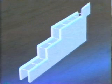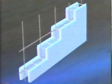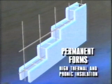The Polycrete wall is made up of polystyrene expansion type 3 prefabricated sections that can be inserted into each other. Specially designed rods allow for the desired spacing and determine the thickness of the wall. Rebar is installed between two parallel panels, forming the wall's armature. Thus, we obtain a conventional form offering the advantage of permanency, and the polystyrene prefabricated section acts as a thermal as well as phonic insulator.